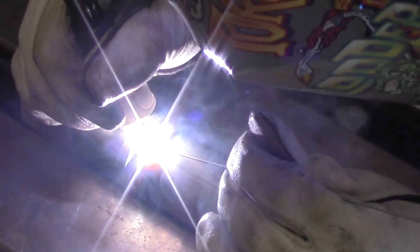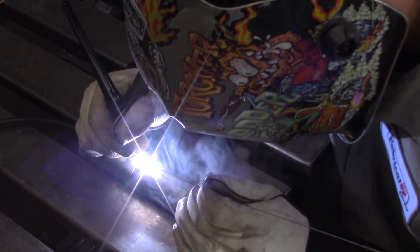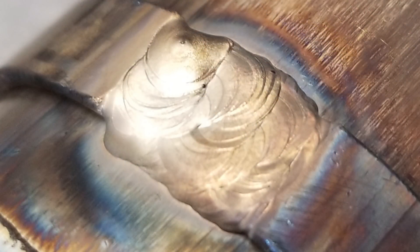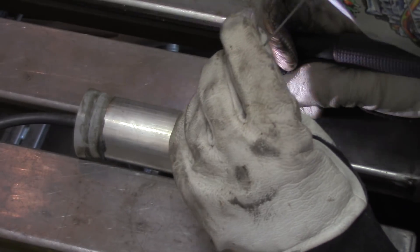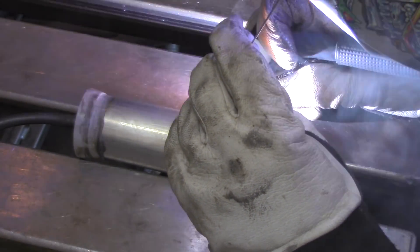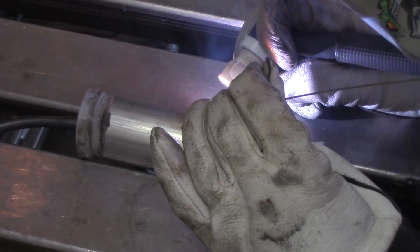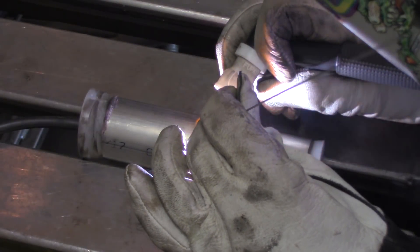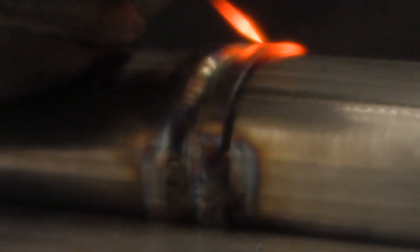Now, I don't pulse much, and you'll notice that the pulser is on here. To minimize the amount of heat input and keep the build up and freeze that puddle nice and quickly on this weave and on this build up, I decided to stick it around two pulses per second and only 20% on time. I'm doing this in short spurts and keeping that pulser active. The idea of going in short spurts is to not cook the crap out of that ring — remember, that's only very thin stainless and it's not very thick either, so it builds up heat relatively quick. Each time we weld, put a pass down on it, let it cool down, then move on, put another pass, let it cool down again, and just keep on going until you're all the way around the tube.